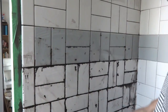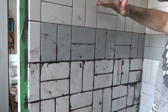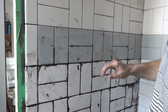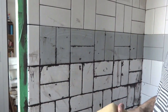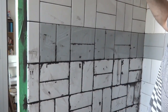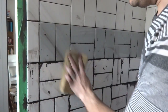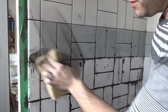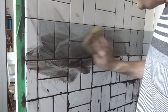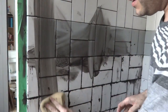I let it sit for about five minutes after scraping, and now I just have to wipe it down. Also, when putting grout on, only work with the amount you're comfortable doing — don't do an entire wall, because by the time you get to the bottom and start wiping the top it'll harden so much you can hardly take it off. We learned that the hard way last time. On this eight-foot wall we're dividing it into thirds. Take your sponge and start wiping all the excess off first, then start evening out the lines.